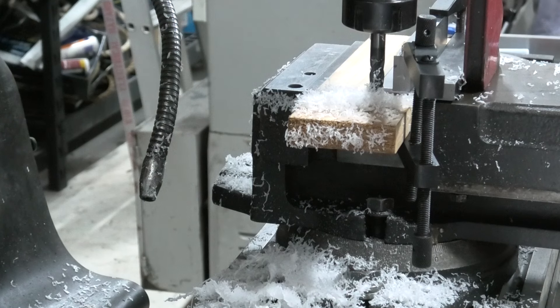Like all machine operations, you get up to 26 out of 30 and you get a bit better at it. I also put a new cutter in - even though the previous cutter had no visible signs of wear, the cut is now almost burr-free. I ended up taking a 1mm pass and only making two passes out of it, and it still does an acceptable job.